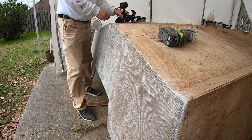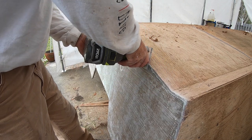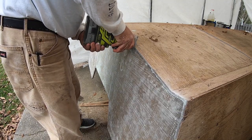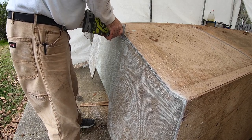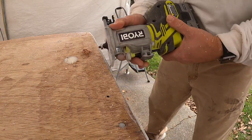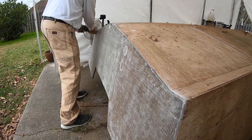Here's a little behind-the-scenes footage where I get this other camera set up - you'll get a different angle here. You can also see right here where I changed the depth of the router, because you can see the first six or eight inches have a little shoulder cut, and then I'm having trouble getting it to cut because I just moved it just a little bit. The problem is because of the angle - that transom is about 10 or 12 degrees - it's got it a little wonky and it just won't cut right.